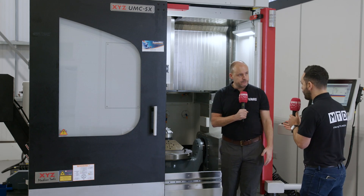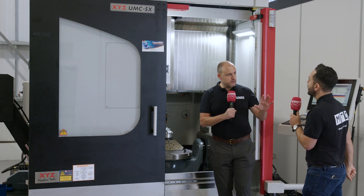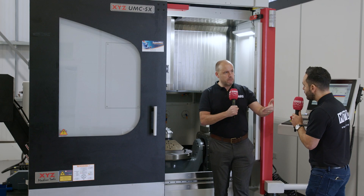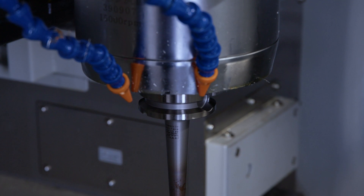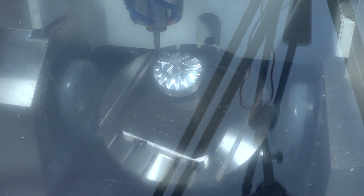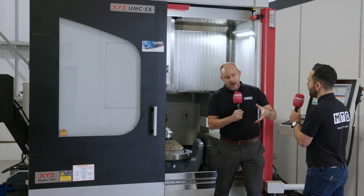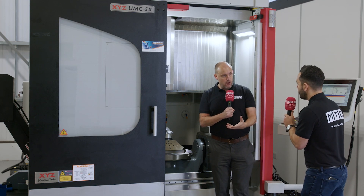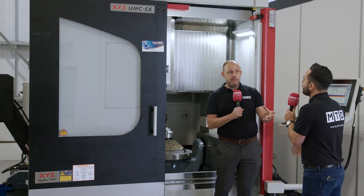Taking a weight of 600 kg, this is not restricted to any material — it's a high-torque motor. There are various spindle options; the standard spindle comes with a chiller — top quality spindles on this machine. The table itself is a direct drive table; it can rotate up to 90 RPM. It's not that you'd want to turn a part on this machine — the point is you want to go from position to position very quickly, which is where this table scores. Being direct drive, it's much more agile, much more accurate, and will last a lot longer.